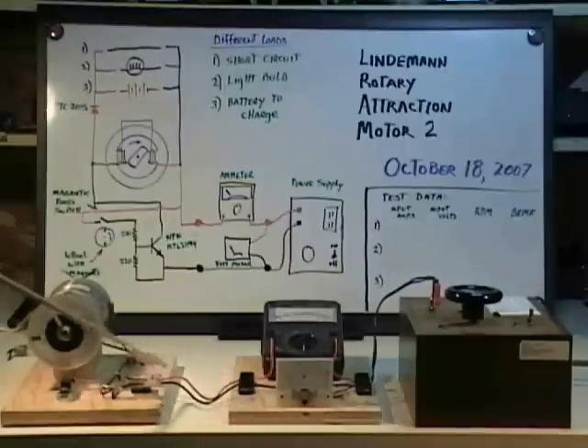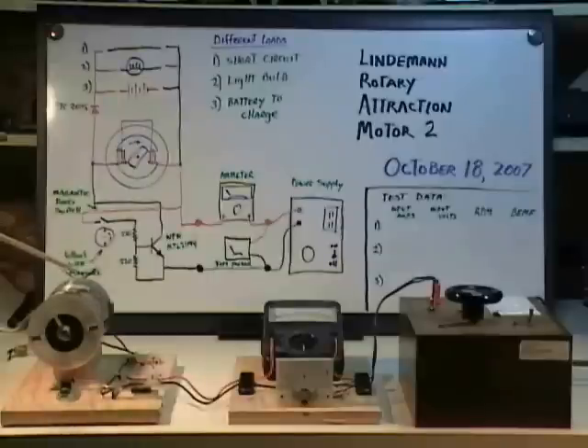The plus and the minus — the red and the black — come through to this terminal block here and are used to power our motor demonstration. The motor is a variation of a series wound motor with a wound rotor and a wound field. What we have done is modified the rotor section: we have taken all the windings off the rotor and cut the rotor so that it just acts like a bar of iron.